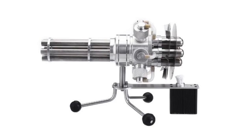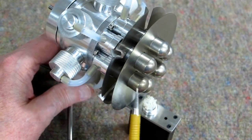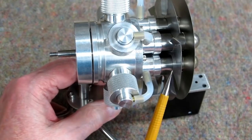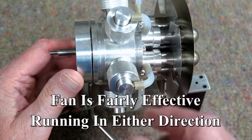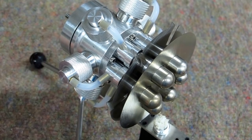This is a six-cylinder rotary Stirling engine which looks and sounds like a Gatling gun. This is a heat shield — its job is to keep the fire from heating any more than just the end of the tube. And then this is a fan. These tabs push air and blow it across these cylinders to keep them cool for a bit longer so the engine will run for a bit longer.